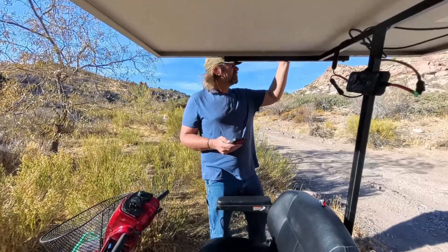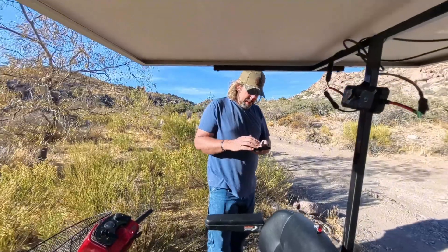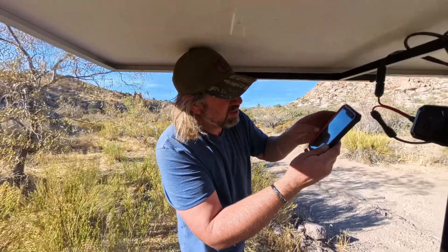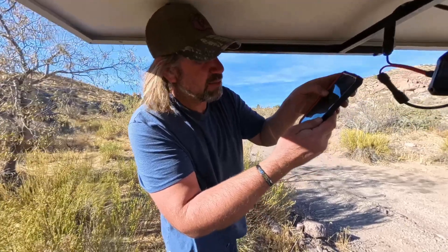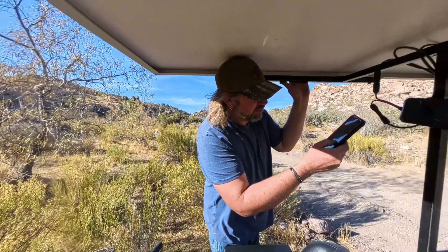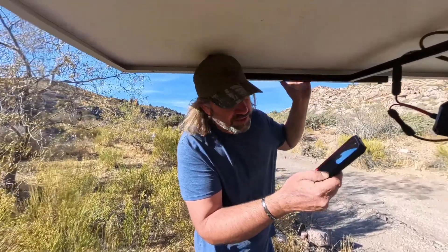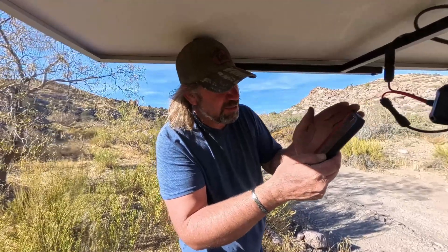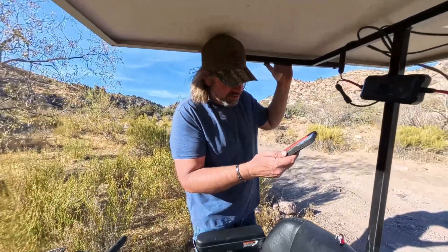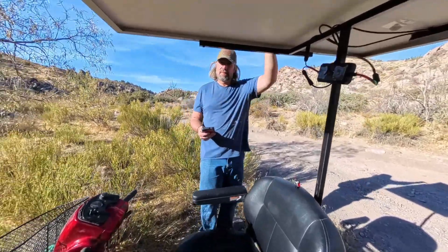Now we're up in the mountains — we took this for a drive on our camping trip, about two miles in. Going into the Bluetooth app — Charge Pro Connect — we've got 26.7 volts on the batteries, charging at 1.85 amps, about 49 watts going into the batteries. The controller is at 84 degrees. You can go into historical data as well — there is that feature. So far I'm really liking it, it's working really well. We'll catch you guys in the next video.